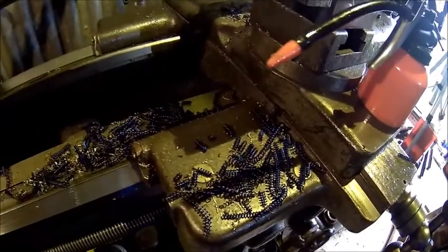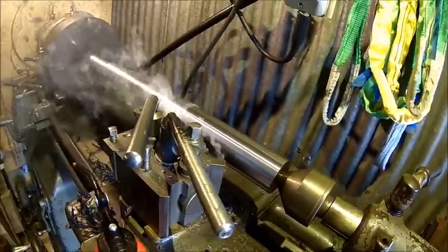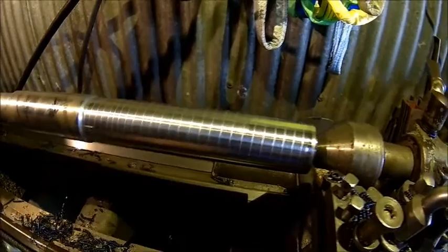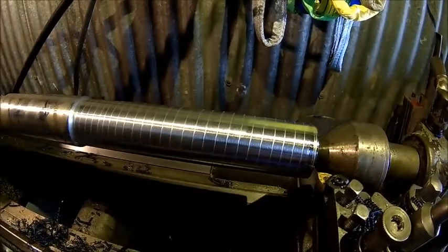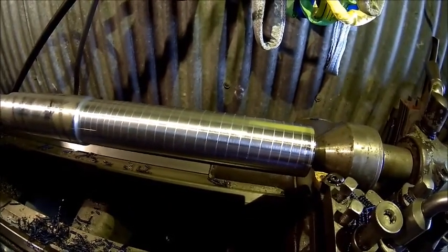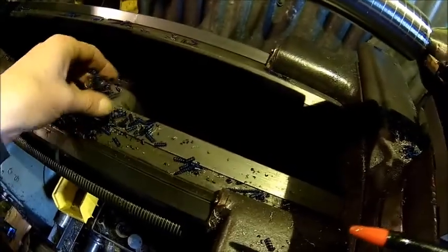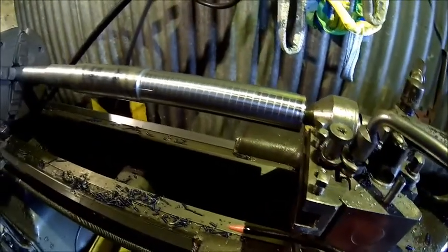Look at these lovely chips here — it's doing a lot. I'm surprised. I'm still wondering how long it's gonna last, because it's not the average amount of steel. I'm surprised how little heat this actually puts into the material — the chips are getting really hot, but the chip looks fine and I did some really heavy cuts just now. Temperature looks okay. Very nice and crumbly chips, pretty big chips. I only have two horsepower on this machine, so that's where you run out of power with deep cuts.